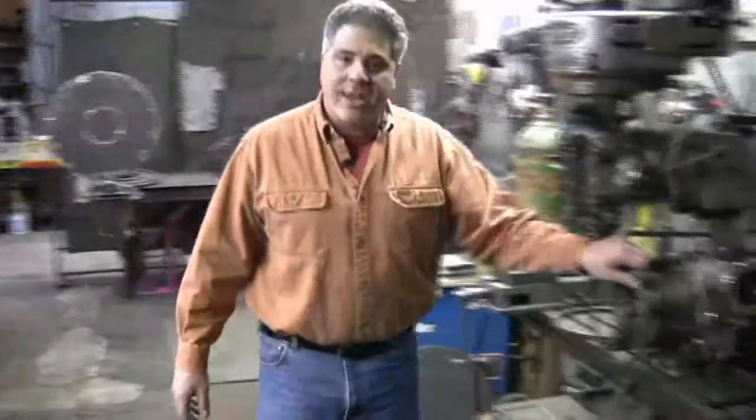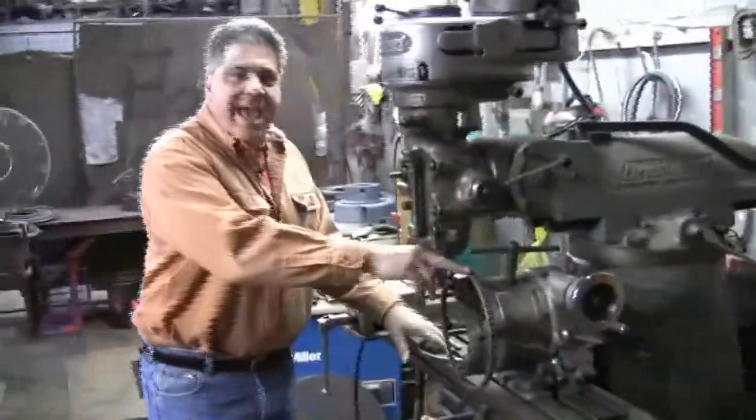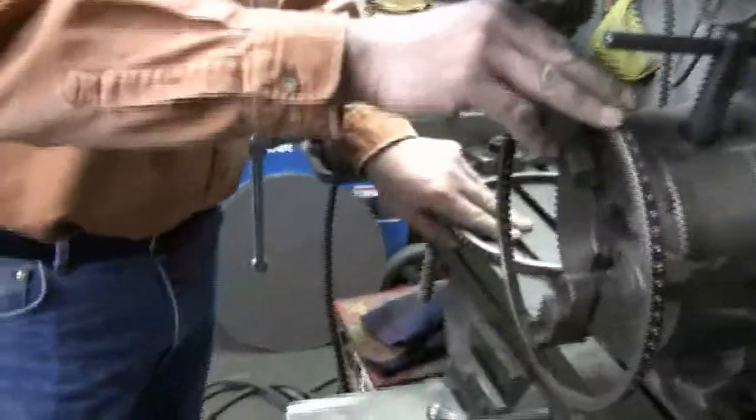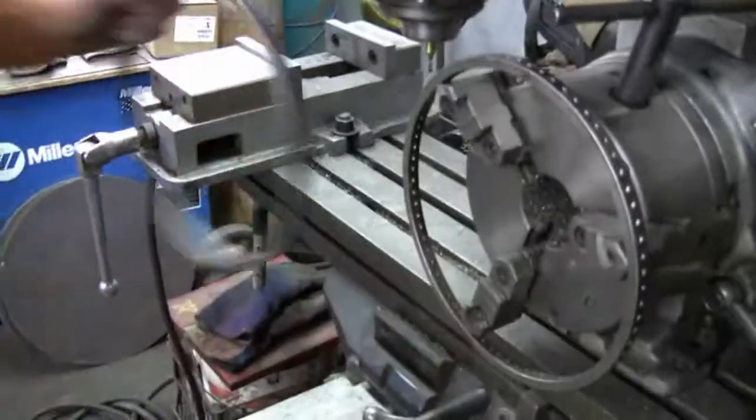This is our gas ring. Our gas ring is specifically designed to maximize efficiency. We have a 33-degree angle on every hole that gets incorporated into every gas ring. This gives more complete burn rather than just pumping the raw natural gas into a combustion area in the burner. Everything is fabricated here.